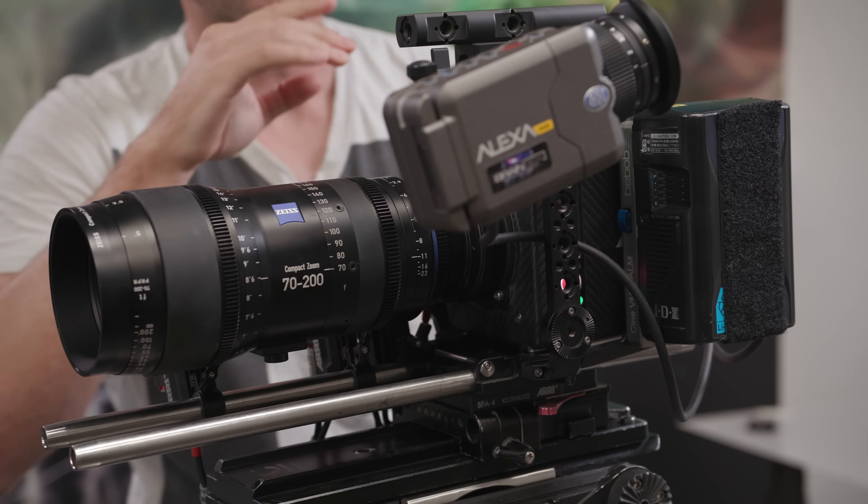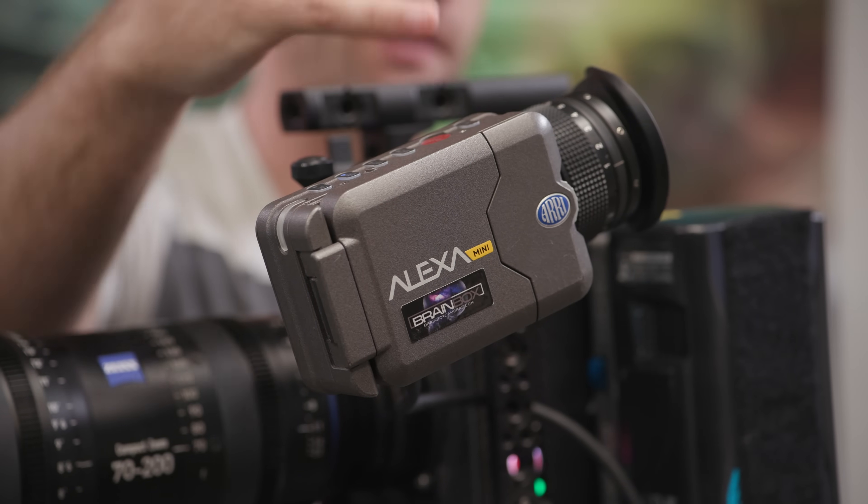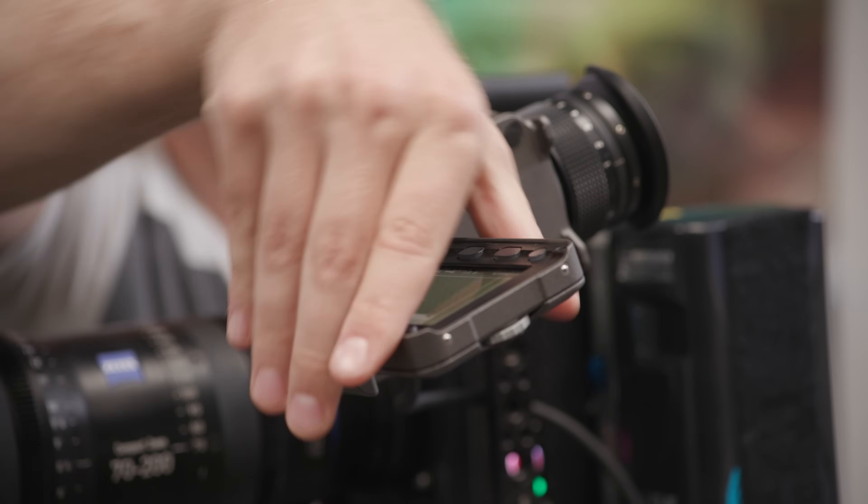On the operator side of the camera, this is how you control it. Because it's so small and lightweight, you don't have a typical side LCD panel with user interface buttons. You basically have to control the camera through the viewfinder. The viewfinder acts as both the viewfinder and LCD screen — this LCD screen will pop up and you can look at it that way, or rotate it and fold it in. This menu gives you full control of all camera settings. And because this is an Arri camera, that does not mean it's complicated — Arri has done a really good job engineering the user interface to be very, very simple to use.